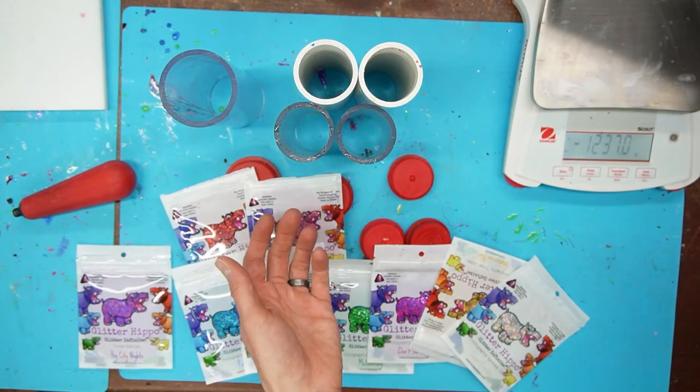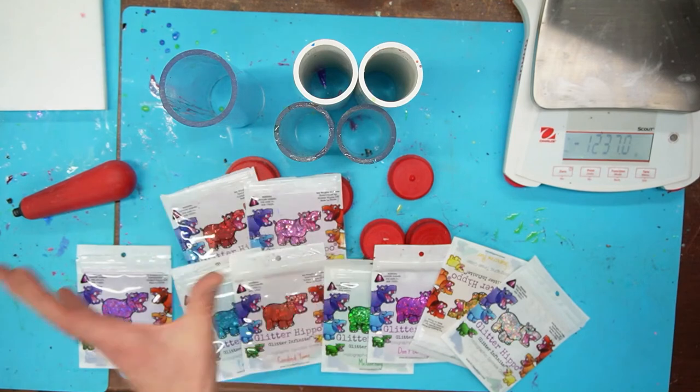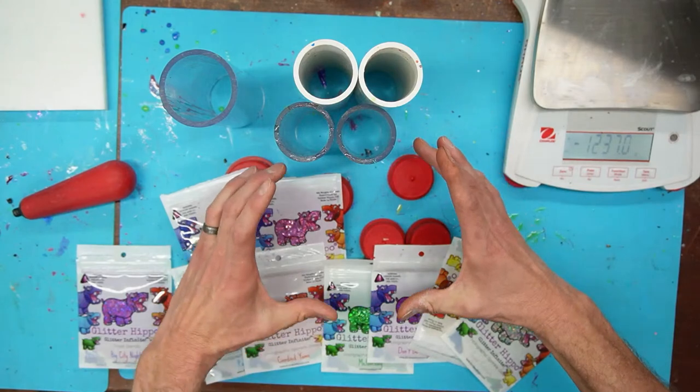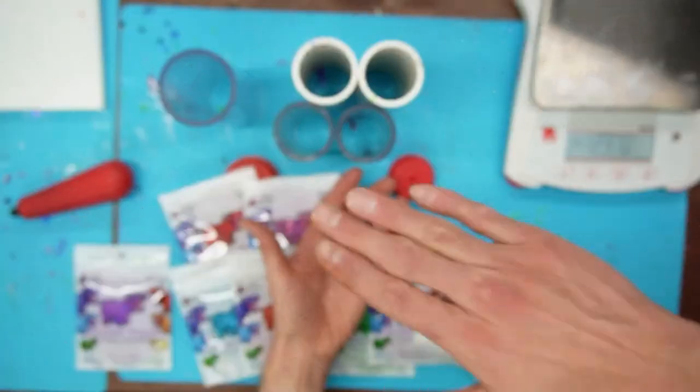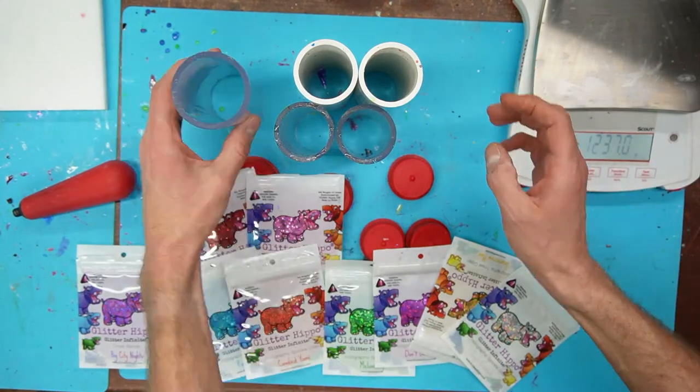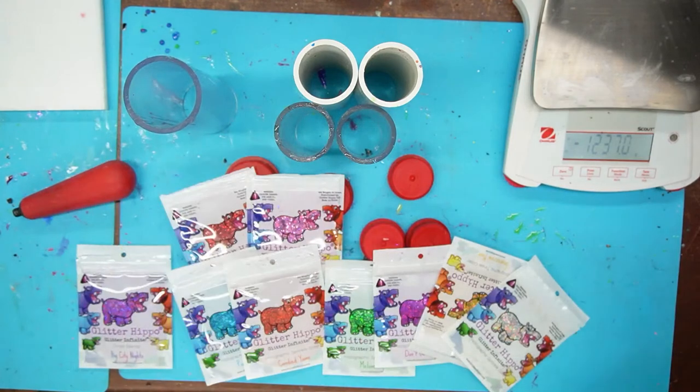I think they have from, I want to say, 1/2 inch all the way up to 4 inch, and maybe even bigger ones possibly. They might even have a 6 inch. I don't know. I might get a little bit worried at 6 inches. Bigger, 4 inch works fine. I would be maybe a little worried because you got so much weight depending on how big that blank is. And even with the 4 inch ones, watch out, you don't want to pick it up and have the weight of it push the plug out.